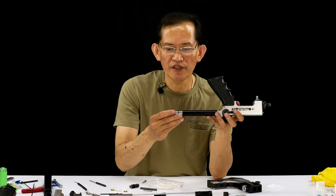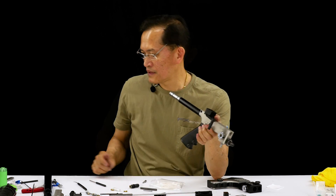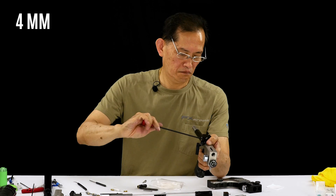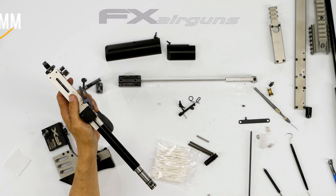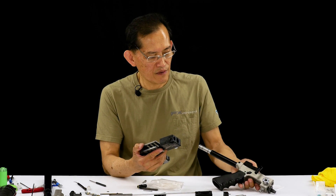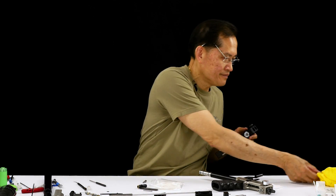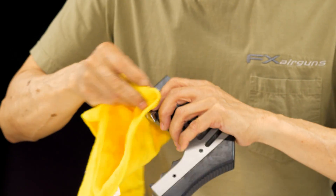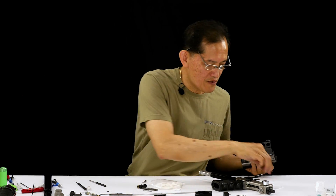I don't want this rotating, so I'll apply a little bit of tension on this clamp to hold it — just slightly until the valve housing doesn't move. While I'm sliding in the rear block, you've got to inspect the rear block, clean any old silicone out front here, and inspect inside.